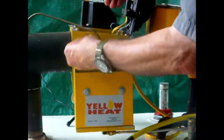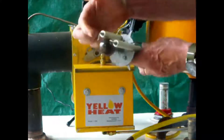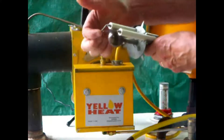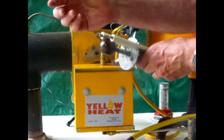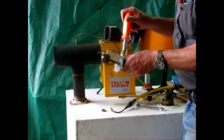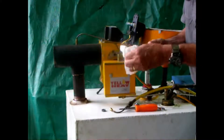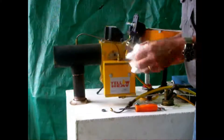This is the patented Babington ball burner head — the unclogable burner head. Compressed air comes into the pipe and exits from a very small hole, and the oil is a film dribbling across the surface of this ball. When it gets near that jet, it's atomized into a very fine mist. These white parts are the electrodes. There's a 14,000-volt spark between them, and that ignites the spray or mist of vegetable oil. To clean the electrodes, take the drawer and undo the one screw a turn or two — that loosens the electrodes. Then take a paper towel and clean off any black, taking it down to the white ceramic of the insulator and the standard metal, and then put it back together.